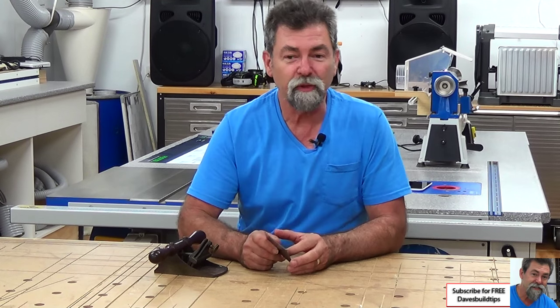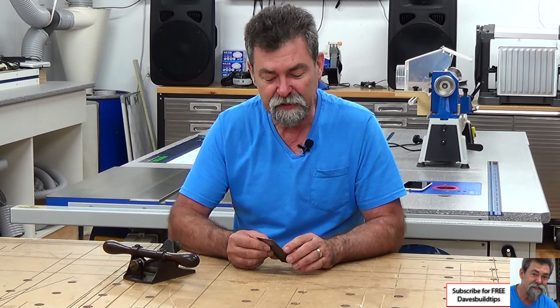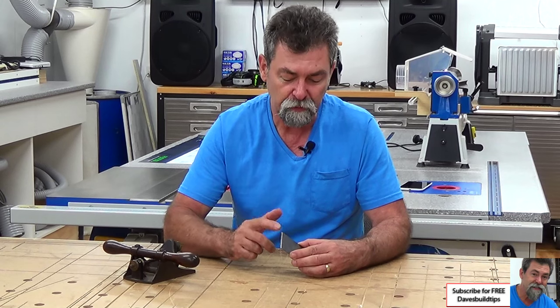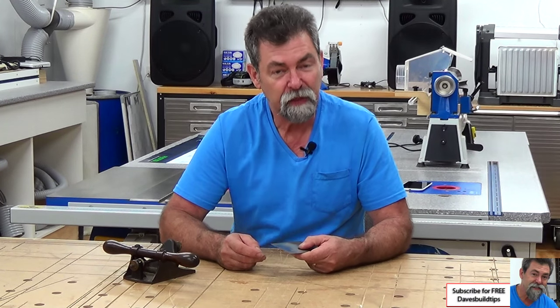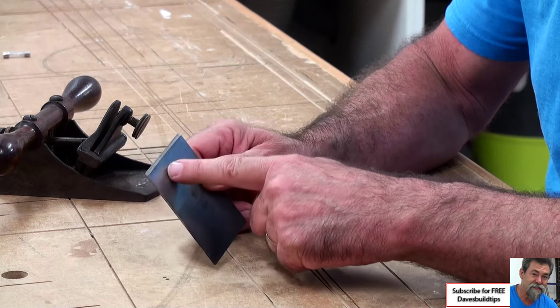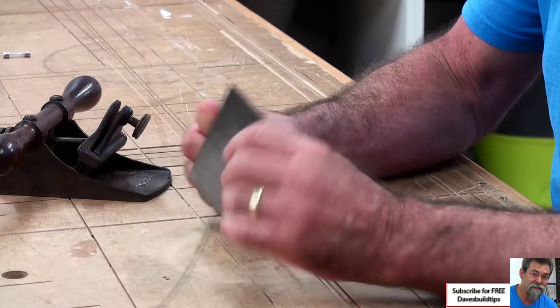Well, that's true. But I've been reading in a book that I've purchased since I started doing this series. They said a chairmaker does things slightly differently. Chairmaker scrapers have a 60-degree bevel on the end of the scraper, and then they pull the burr on that. Which is great, because this already had a 60-degree bevel when I opened it up. So it's a little discovery.